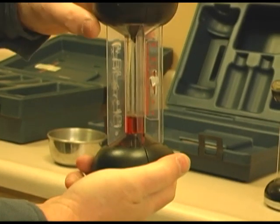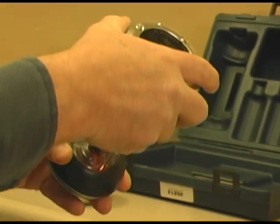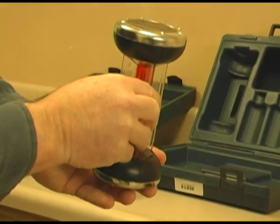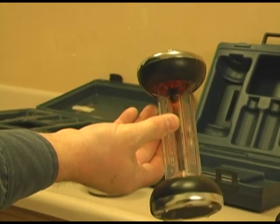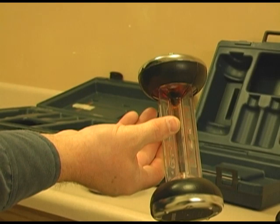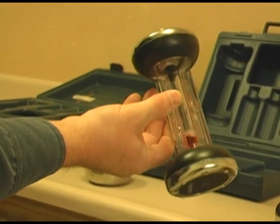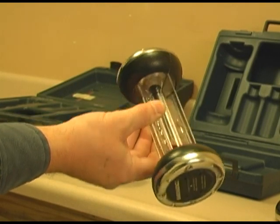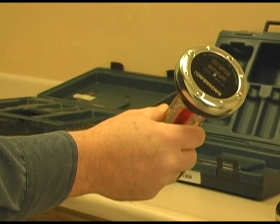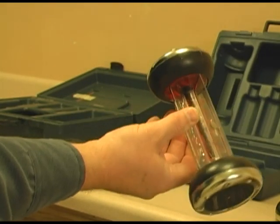Now if I want to check this, what I would do is re-vent it and hold it upside down. It is good practice to hold just the fins and then invert it. Notice that I am holding it on an angle that allows the Fyrite solution to flow a little better downward. I am going to do it twice to make sure I get a good atmospheric CO2 reading of zero.